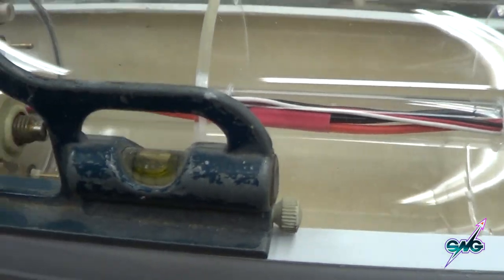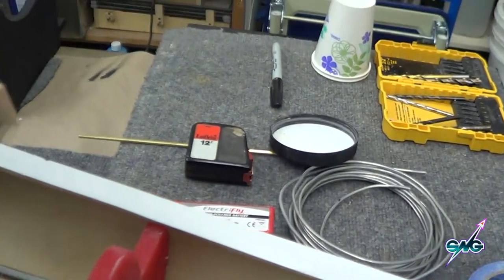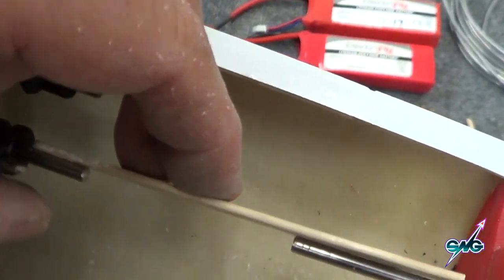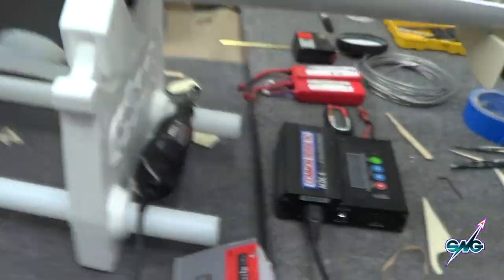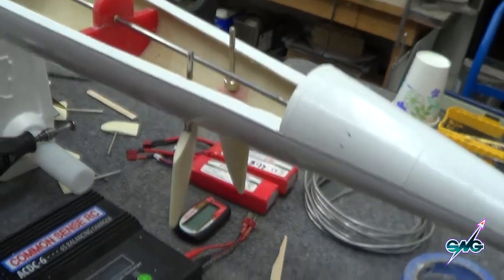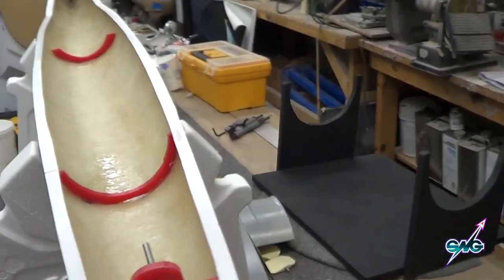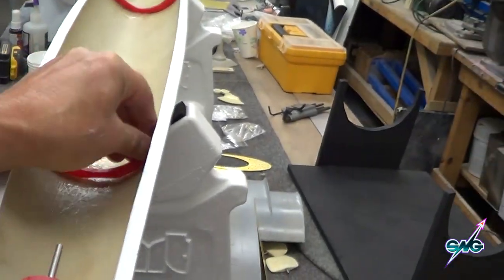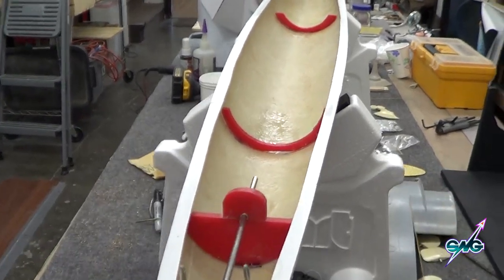It helps if I have the camera on — I do that a lot and I apologize. It's really really close and certainly going to be fine. We're lined up this way too, which we apparently are — I made a teeny bit off but very slight. Now I'm going to fix these bulkheads into the cylinder, then put some stops on it so it won't go forward and back, and hold-downs to keep it from floating up. Both bulkheads are in — I used CA and some kicker and those things are in there so strong I don't need epoxy. Very strong and very clean, which I like.